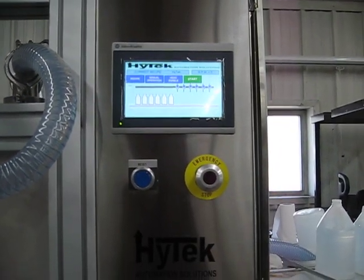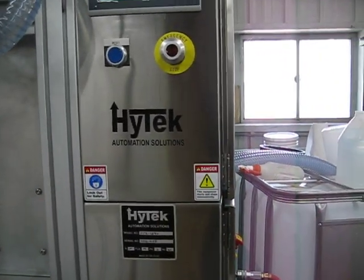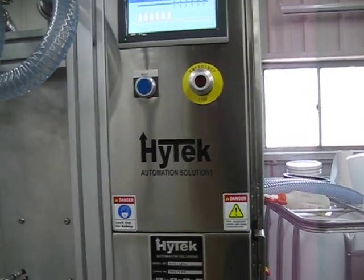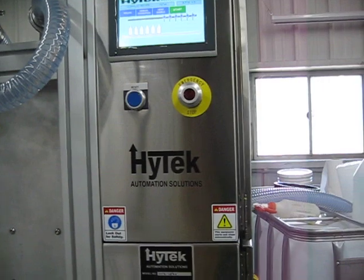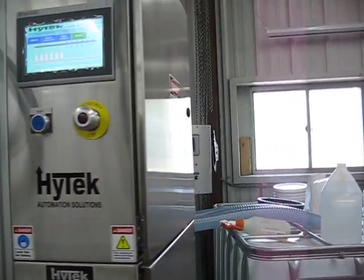and we could actually start running again. We have lockout tagout, so if we're going to do anything on this machine, you must, per NFPA 79, lock out this machine. You're going to lock out all potential energy, electric and pneumatic. We'll show you how to do that here.